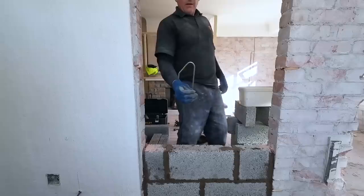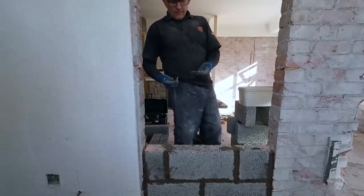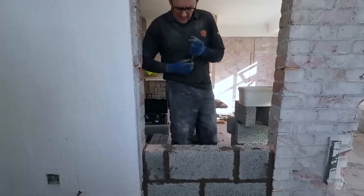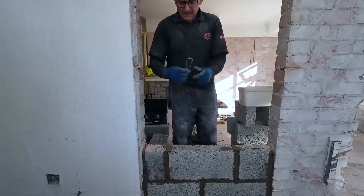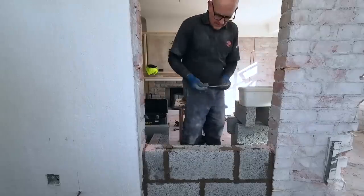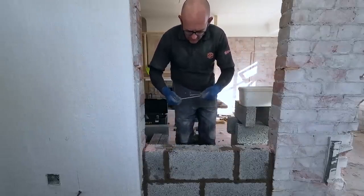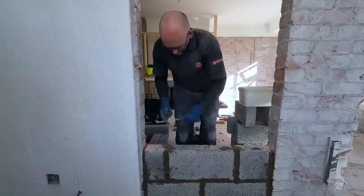Frame ties, from Screwfix and Toolstation. They go on a 10mm plug. What we do is we squash them in like that, and then they sit nice in the can. Put them in like that, but they take up a lot of room when you're screwing them in. So when they're squashed in, you can always open them up again, I suppose, but that's plenty.